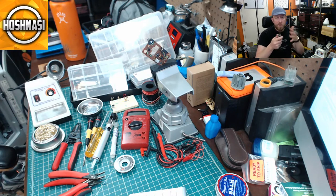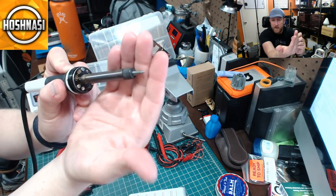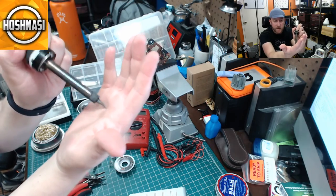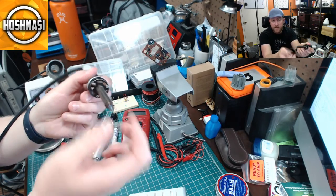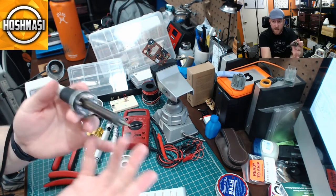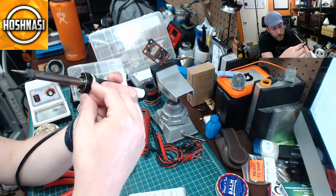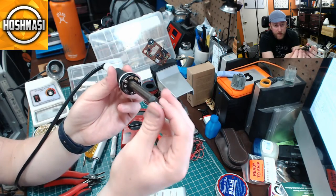Digital is a bit nicer because when you start it, it gets hot very quickly and you can accurately dial in exactly the temperature you want. When you get a soldering iron, make sure you get a tip that's nice and small so you can precisely apply heat to the component. Soldering irons with an easy-to-remove tip are nice — this analog style is very simple, it just gets really hot, and it's been my workhorse for years.